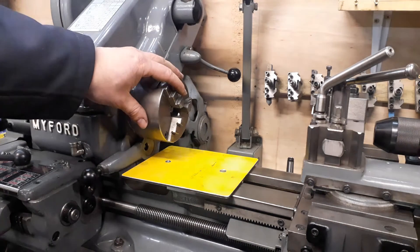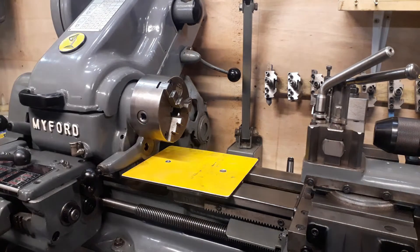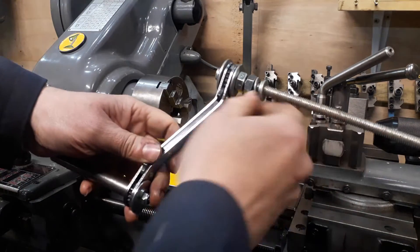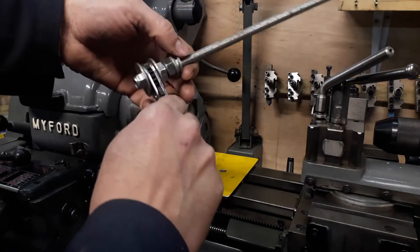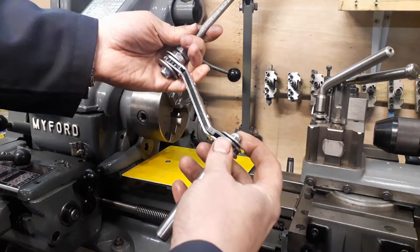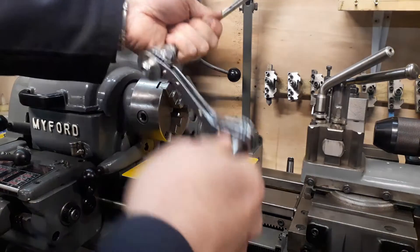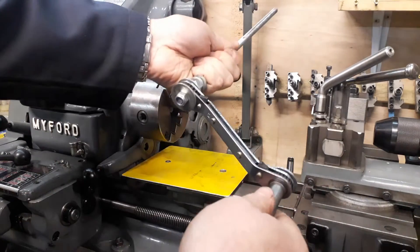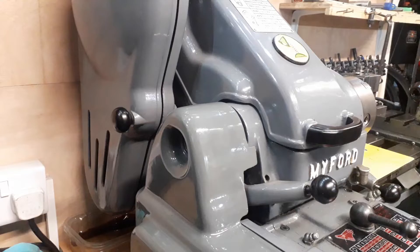This also doubles up to give you a drive handle — the drawbar is replaced with this drive handle. Again, it's a piece of M10 threaded rod; I've turned it down at the end and threaded it M8 to take a 13mm nut, because this is a double ratchet spanner that's 13mm and 10mm. This bit of bar has been turned down to 6mm. When you've got it on the headstock it's actually driving — you can either use it round and round, or you can just ratchet a bit at a time.